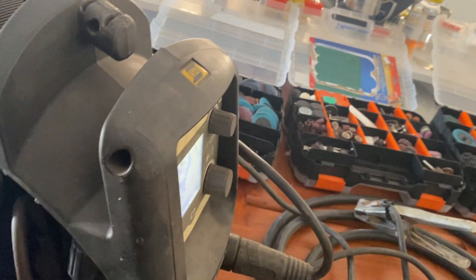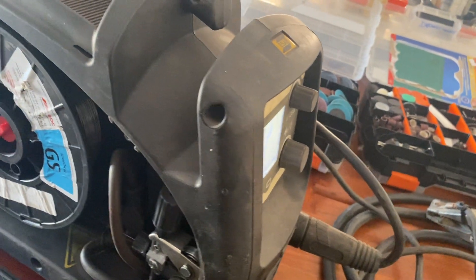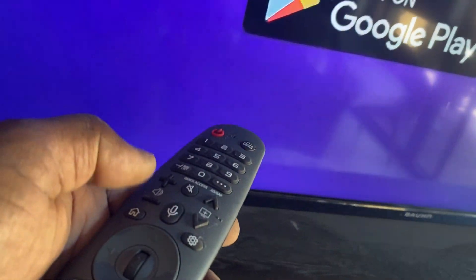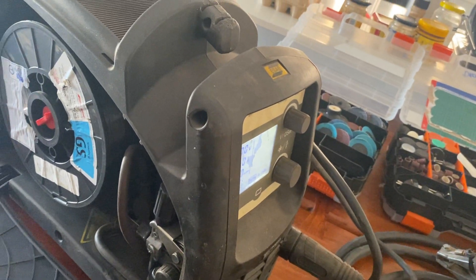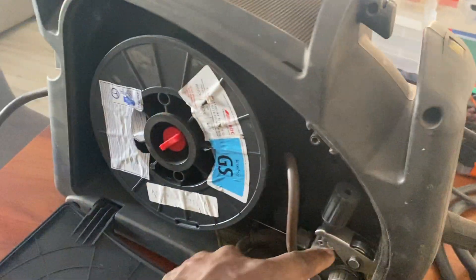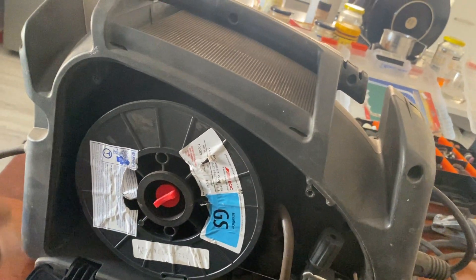In order to do the modification you need to buy one of these connectors — it's called a euro torch converter. You can find them on eBay. Search for the 24-volt motor and the MIG motor, and that's what you need to get.